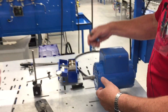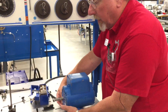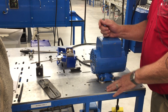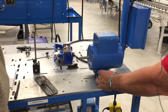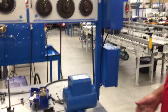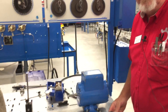Because we had to put the feeler gauge on this side to lift it up, we're going to have to lift this motor up on this side. So we're going to put seven thousandths in both of the front feet — not just one, both. That'll bring this up, and when we do that things should come out nice and perfectly level. If these bolts were 30 inches apart, we'd be doing 70 thousandths — see how that works? It's a ratio. It's just the angle, and the longer it goes, the farther. We could level this whole table doing the same thing. Let's go get the shims and do that.